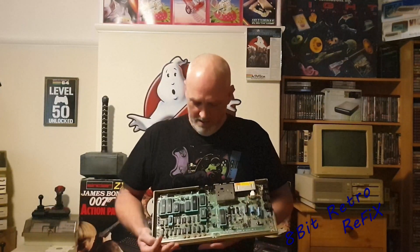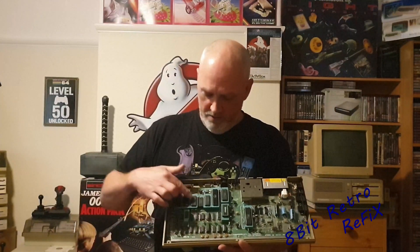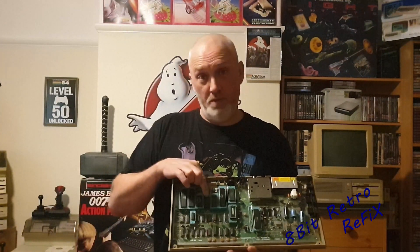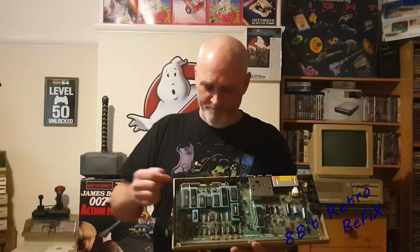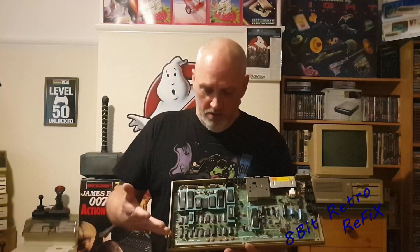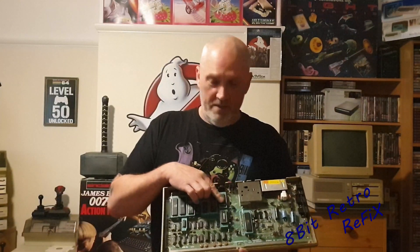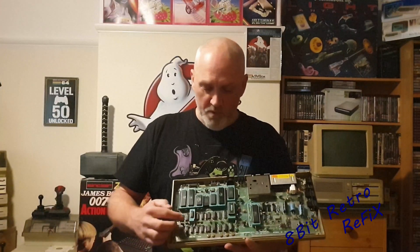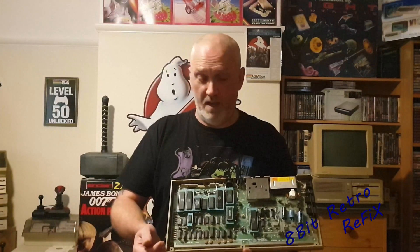I hope you've enjoyed that episode and seen us build the ZIF-64. We've got the CIAs in, we've got memory, and we couldn't manage to get all three of the character, basic and kernel — it would have been a trade-off. The CPU's done, the PLA's done, the SID chip's done. I didn't want to ZIF the logic chips at the bottom because you can test those in an EEPROM burner — just pull them out and test them there. If you guys have any ideas on narrower ZIF sockets, please drop me a comment and a link where I can pick them up so I can get those three changed in and get it fully ZIF socketed.